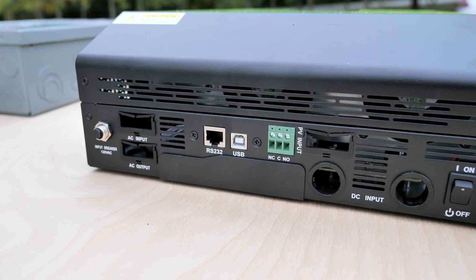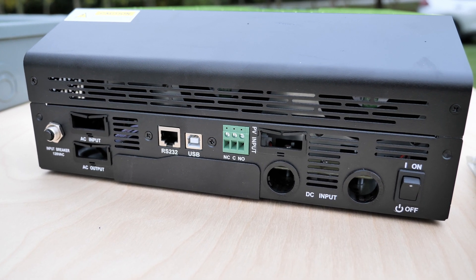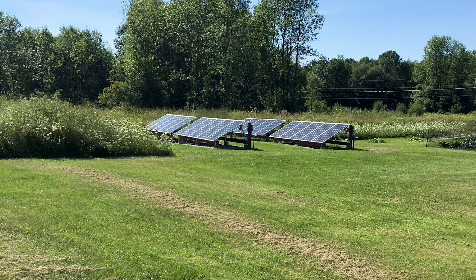I also want to mention that by using MPP Solar, it's not a UL-listed device, so you can never use this to truly grid-tie — legally, at least here in the United States. On my system we have a grid-tied roof system and a DIY solar system out in the field; that's all legally done, I have a permit for that, I'm using all UL-listed components. So if I use an MPP Solar component like this — not UL listed — I'd be breaking the permit that allows me to back-feed, as well as exceeding the capacity I'm rated for.